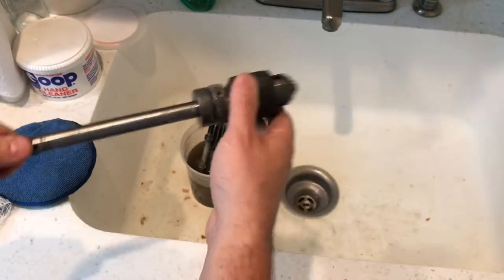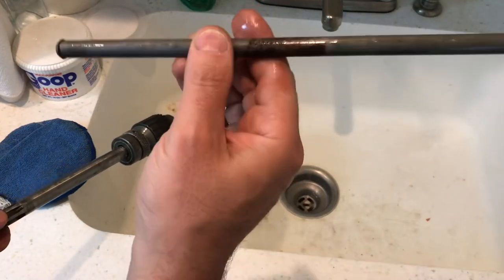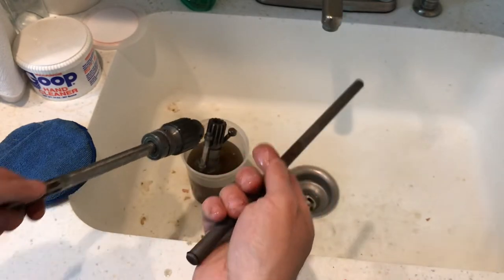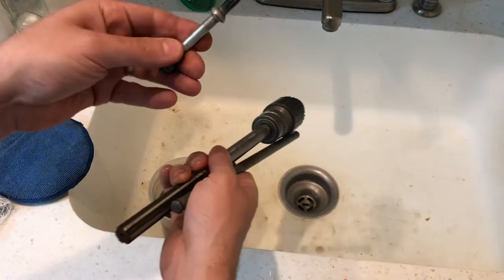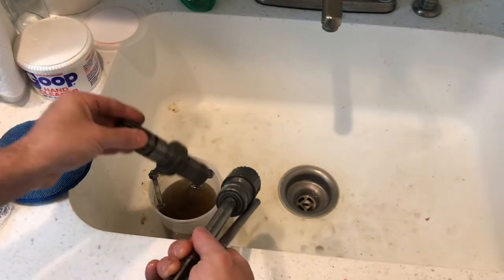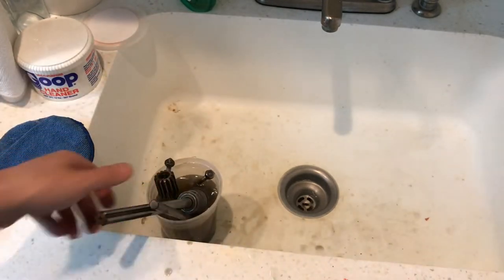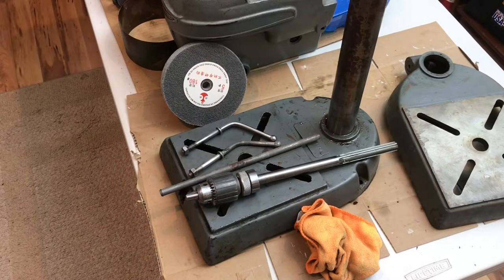If you remember from the pictures, they had heavy rust on them — looking pretty good now. I'm going to clean them up — just take a look at the handle, you can see where the Evaporust mist worked. Soaking in the Evaporust makes cleaning up so much easier. I'll get everything onto the fiber wheel and wire wheel to make a nice shine, then wax them up and get them back in place.